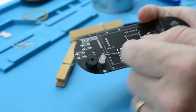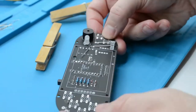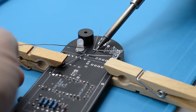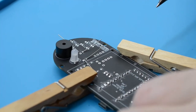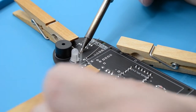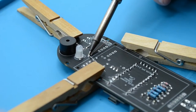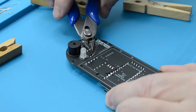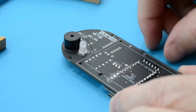Turn the PCB around and fix the capacitors in place by bending the legs. Once the capacitors are secure, tin the bit and solder the capacitors in. It's useful to align the PCB for the best soldering orientation, as this can be quite a tedious soldering joint. As the two pins are quite close, make sure to check these solder joints to ensure there's no bridging — that is where the solder joints would join together. Once soldered, bend the legs up on the capacitors, grab your cutters, and trim the legs down to the solder joints.